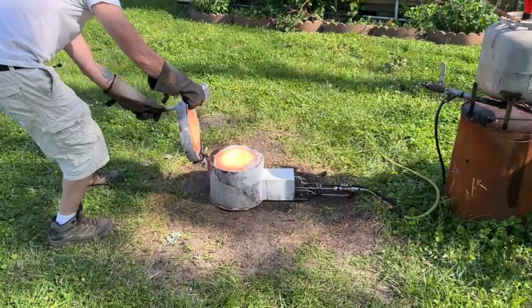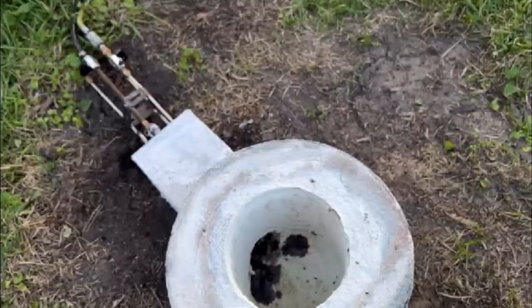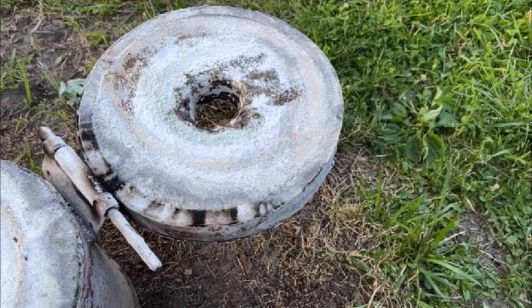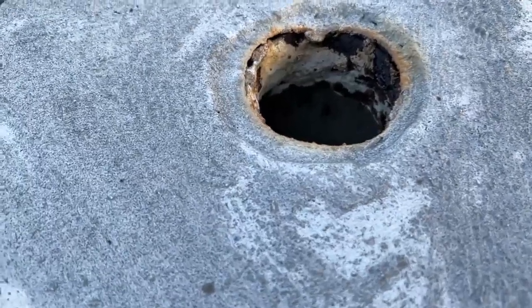So we shut her down and got some temperature readings. You can tell by the color there that it was hitting every bit of 2,500 Fahrenheit no matter what. The footage of the after is damaged and won't play, so here are some pictures. That black stuff is some of the throat nozzle that dripped out — we used a metal piece of form for the lid and it dripped down; that's that iron oxide mixture. As you can see, some of that iron oxide bled through. But for the most part, this new composition held up extraordinarily on the top.